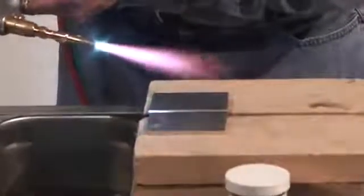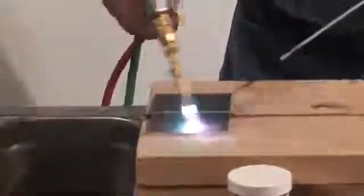I'm going to cut the heat up just a little bit just to preheat all thick aluminum. The larger and thicker it is, the more preheat you have to do. Aluminum dissipates and pulls that heat out too much. You just can't go down and heat up that one little area, so you have to preheat a larger area right here.